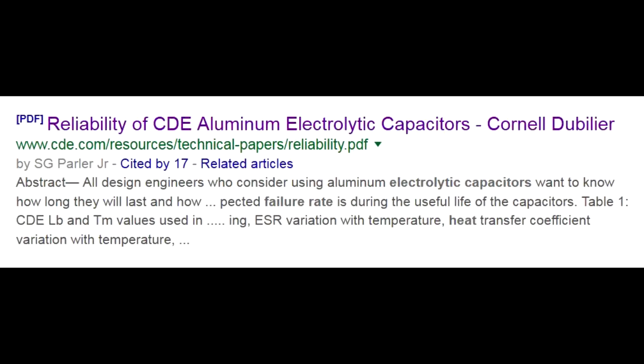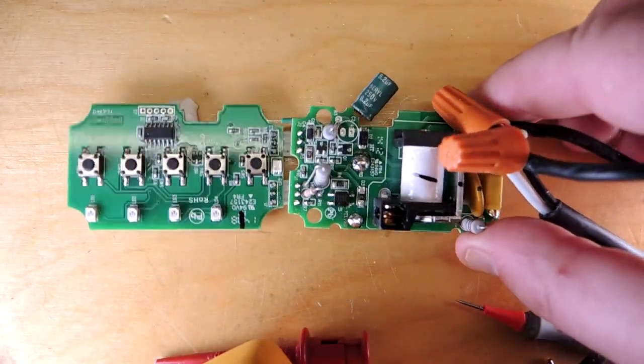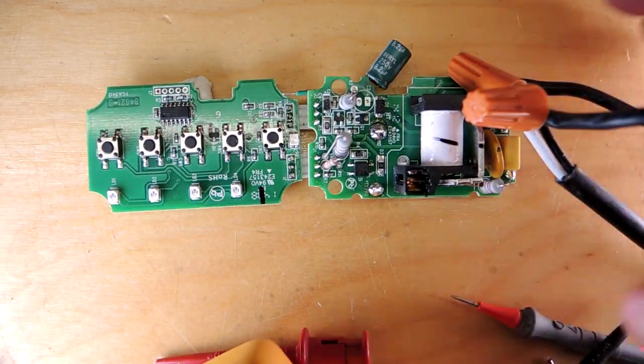The relationship between failure and temperature is really well understood in electrolytic capacitors — there are lots of white papers on the web. One I've grabbed shows that as you increase the temperature by about 45 degrees Celsius, the failure rate increases by an order of magnitude — 10 times. That's one reason you want to keep electrolytic capacitors as cool as possible if your goal is long service life. That was a failure analysis of the Leviton LTB 30, and unfortunately some more e-waste for my bin.